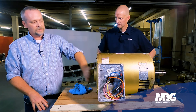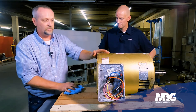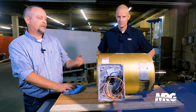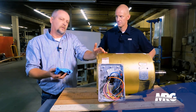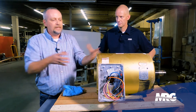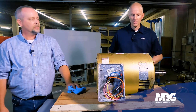If the IOM says to grease this motor, always refer to the IOM. Some guys come every three months and put four squirts in there — that's fine, but the old grease is still in there, so you're packing it and you're going to blow the seal on the bearing. It's super critical to get that plug out and flush it with new grease.